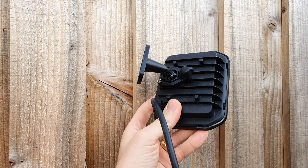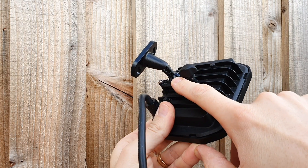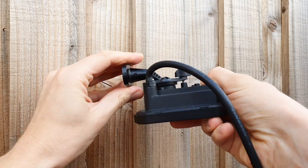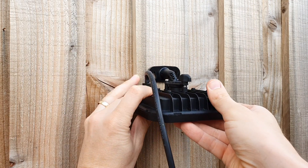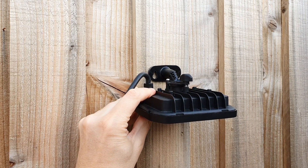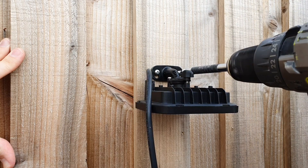Instead of the traditional C-shaped bracket on the back, Luceco have pretty much revolutionised the installation of the LED flood by incorporating this really clever ball joint on the end of this mounting stalk, which has some serious advantages. The first is that it makes installation easier. You can swivel the body of the fitting completely out of the way and access the keyhole slots, so mounting is just a doddle. Then, once the fitting is installed, its true benefit becomes apparent — namely that the range of adjustment is phenomenal.